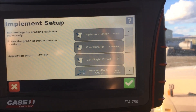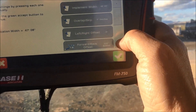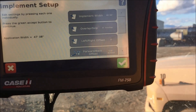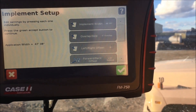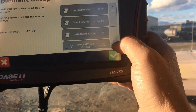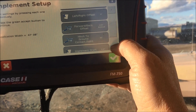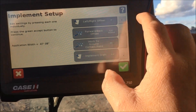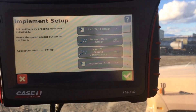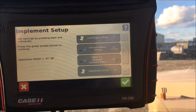That overlap is just so I know I don't skip anything. My right-to-left offset — if I have a drift or a draft in my implement I can put that in. Forward-back offset is how far the implement sits behind me, then my hitch-to-ground contact point. What this does is help you set where your coverage line is actually going to be. If I set this at zero, it's going to steer my tractor straight, not my implement.